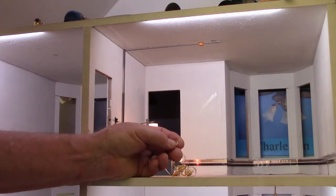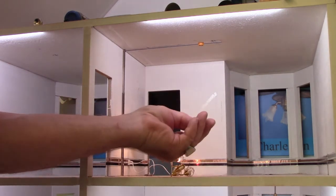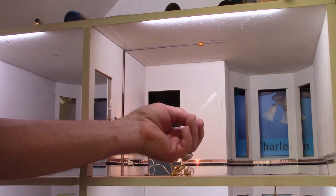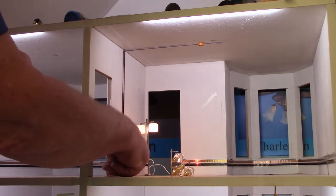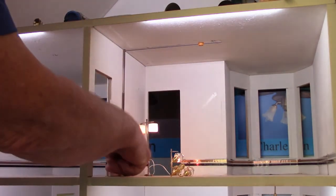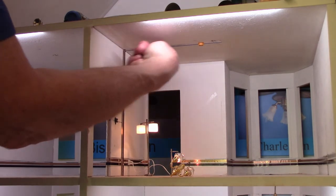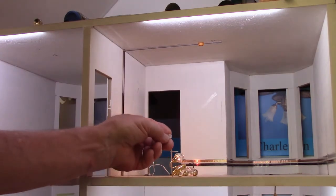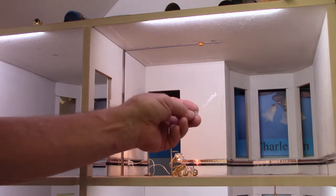and that's our ceiling canopy. With the ceiling canopy, all we have is this little insert that goes into the ceiling. And by far the easiest way to do this is to go ahead and run our flat tape. I have flat tape that's powering the sidewall here from the floor, but we can run a strip up the wall and then across the ceiling. That tape will allow us to make a connection into a live circuit so that we can later plug in the lamp and it all will work.